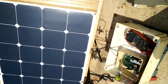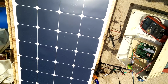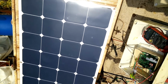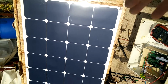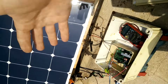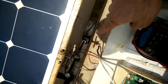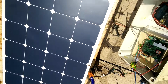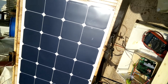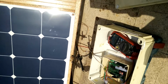Once in an hour, there is an adjustment of about 3 to 5 seconds, which takes between 300 milliamperes and 3 amperes. It depends what adjustment needs to be made: left-right, which is with the stepper motor over there, or up and down, which is with the linear actuator, which takes more. But generally it works efficiently, and most of the time the system just rests.